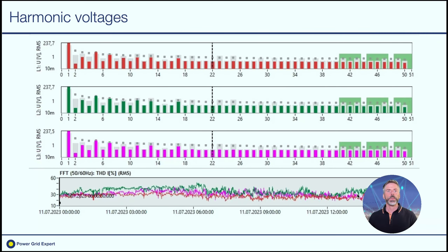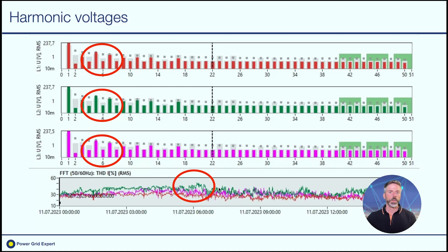Now for the results — let's have a look at them. We start with harmonic voltages up to the 50th harmonic. Basically not much interesting happened here. What we can see is that at the 5th and 7th harmonic we have reached limits that apply to all phases. What might be interesting is the THDI, which reaches nearly 60%, which is pretty high, at least for phase 2. That might become interesting in a future video where I look at future regulations regarding THDI.